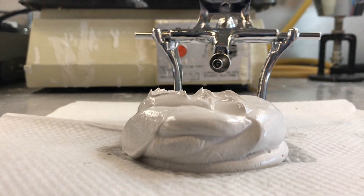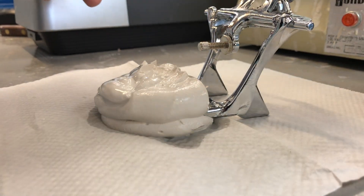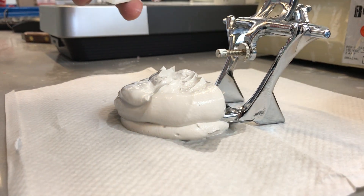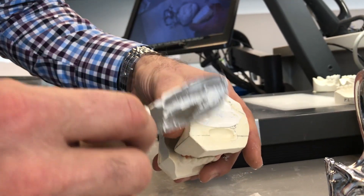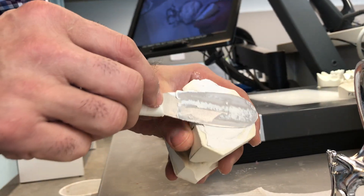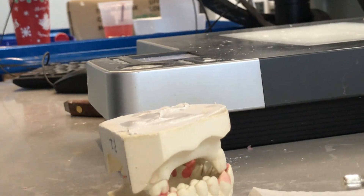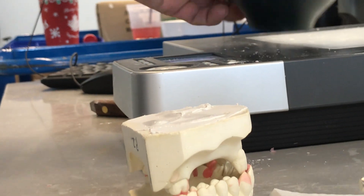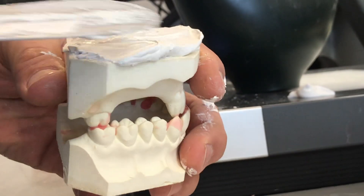I'm not in a rush here because I'm only doing one at a time, so there's lots of time. I'm going to take the mounting itself — I've separated the back of the casts — and I'm going to take a little bit of plaster and smear that plaster inside the keyways. Make sure the plaster gets all the way in; it's not going to do it on its own. Then introduce some more plaster on the back of the cast, all the way to the edges.